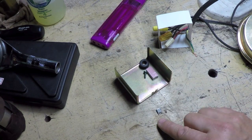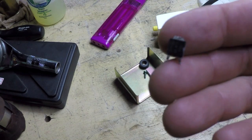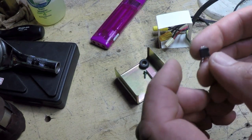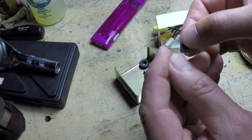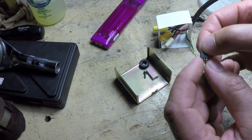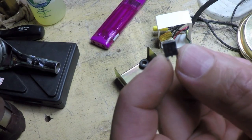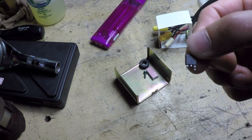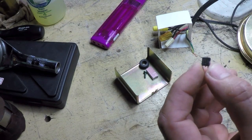There are three legs on the bottom of this device. The middle leg is clipped off because in this application they used the top tab as the connection instead—that tab is common to the middle leg. So the three connections are the left leg, the right leg, and the top tab, meaning I'll have to run a wire off the tab to make a third lead. On a conventional transistor you have emitter, base, and collector; on a field effect transistor you have gate, source, and drain.